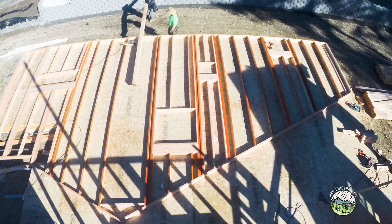Here on the right Kyle's cutting his scrap into 22-and-a-half-inch blocks. We also have a full-height glue lam column that runs from the bottom plate all the way up to support the ridge. Having that out of a glue lam keeps it nice and stiff and flat so that when we lift it, it provides extra stiffness.